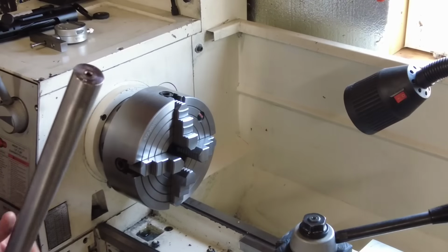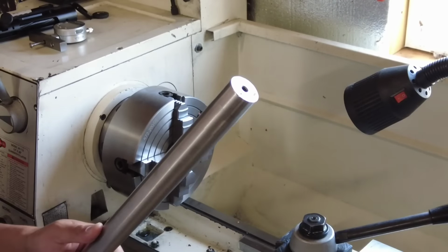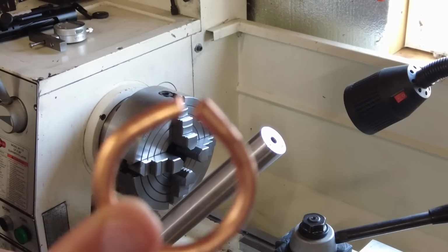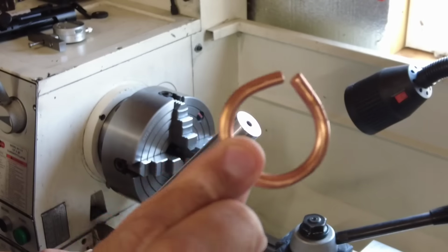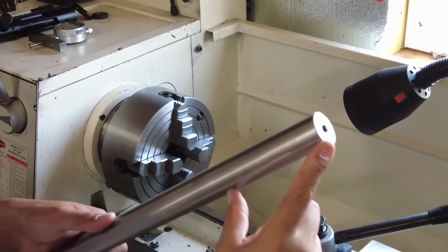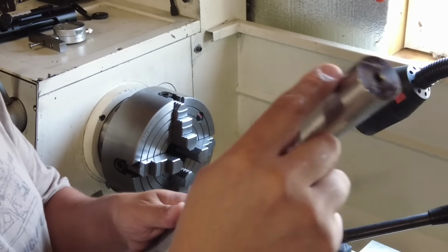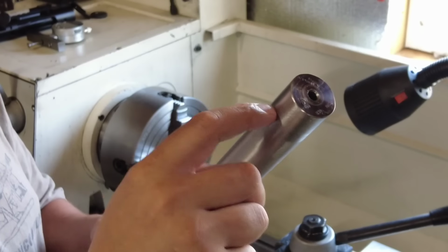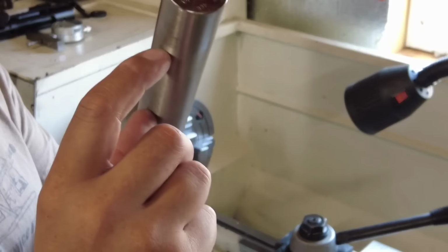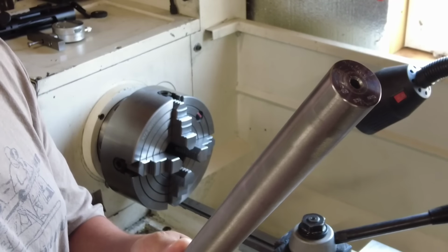So we're gonna utilize a four jaw chuck, and this is basically how I get the barrel mounted onto the chuck. I use something called a copper wire. Now this adds a pivot point to the barrel. I situate this so I have enough barrel protruding outside the headstock here. That gives me enough room to cut off a little bit of the tenon here, or the breech end, and not affect the clamping force being around the chamber, anything near that chambering job.